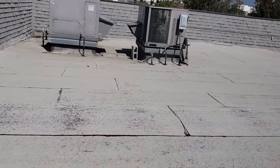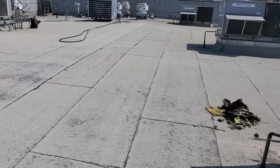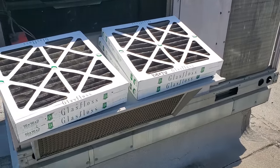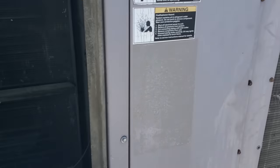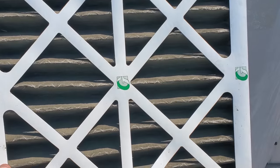I ended up getting all the heaters to fire up — it was just a matter of getting the thermostats to work correctly. Once I got them all firing up, we know that they work. Now we're going to go through and clean up the units. I've already got the customer's permission. Belts, filters, all that good stuff. Clean the condensers too — they actually don't look that dirty. Even the evaporators, they're not that dirty. They could use a good rinse, but that's about it. I don't think we'll need to get crazy with cleaners on the evaporators.